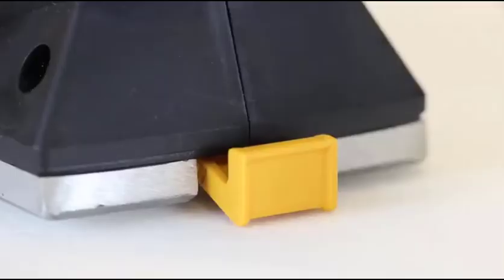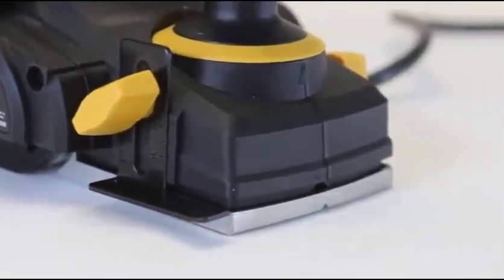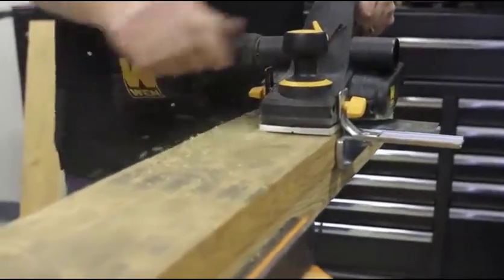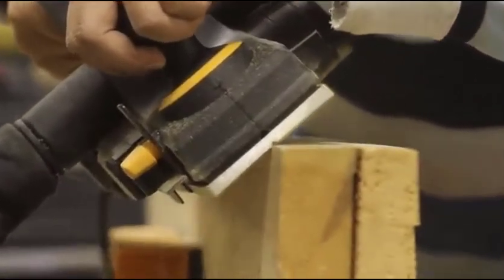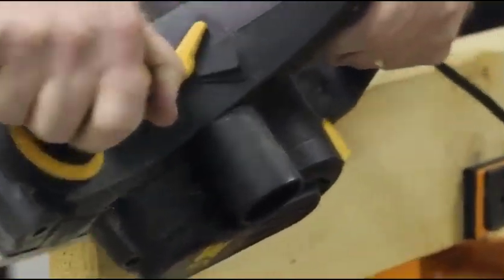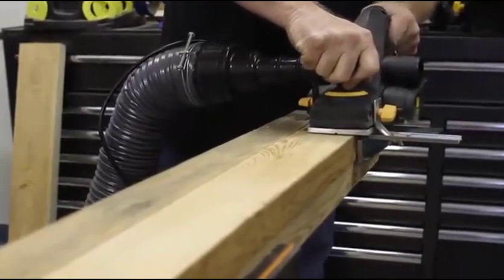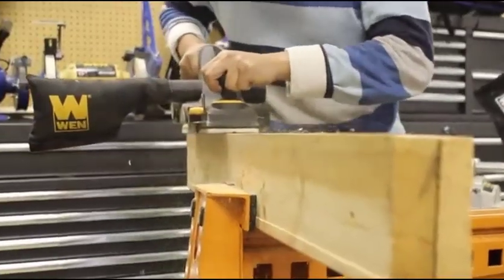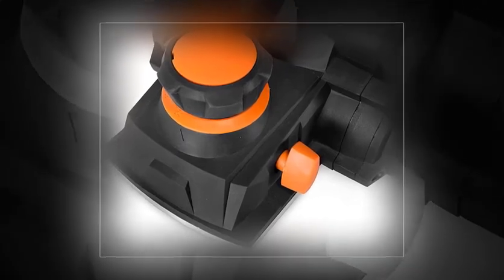Electric hand planer, how do you use one? If you're familiar with a hand plane, an electric planer won't be a tough nut to crack. The tool rides on a sole plate. Plus, it comes with blades on a cutter head like a jointer at 20,000 RPM. So, the difference in elevation between the shoes, front and rear, equals removing wood. The front hand grip is another interesting feature considering that it doubles as a depth adjustment gauge. Also, it's easy to set the depth of cut thanks to the tool's built-in scale settings that turns back and forth to move the front planer shoe up or down.